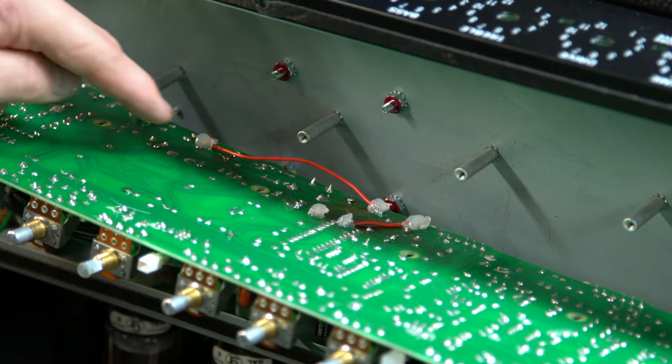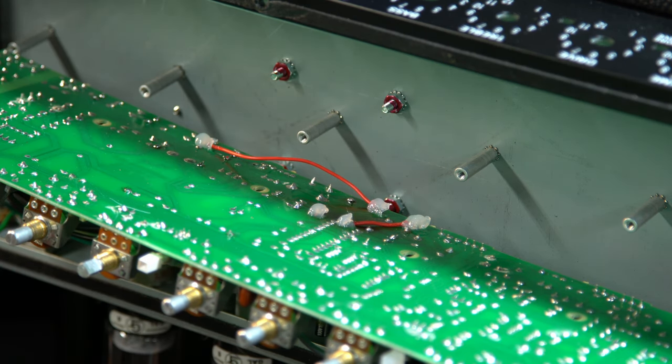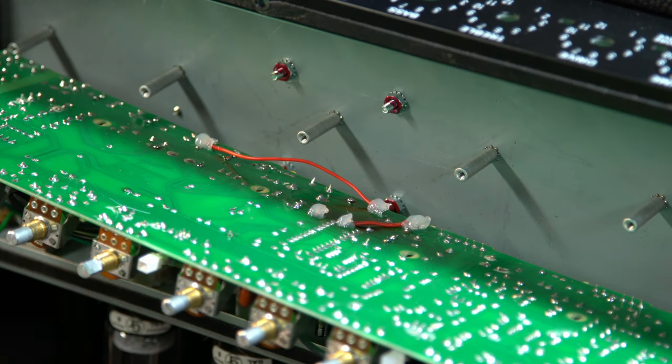As you can see here, I had to do a pretty heavy bodge wiring because, as usual with these Fenders, they roasted the traces. Just removing the resistors that were bad and putting the new ones in, traces came right off — they were like paper thin. So since I was replacing the capacitors anyway, I was able to put the leads through, wrap the wire around them, and then solder them together. Then I put some silicone there just so they can't vibrate and move.